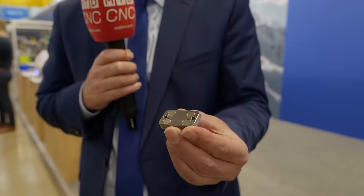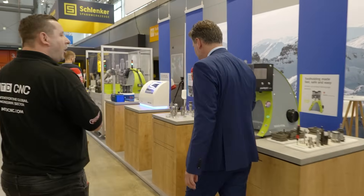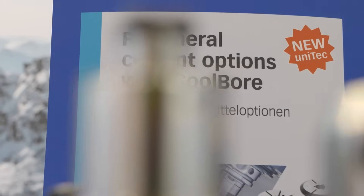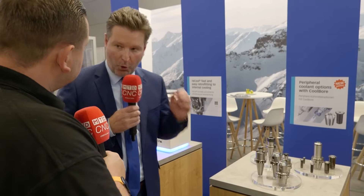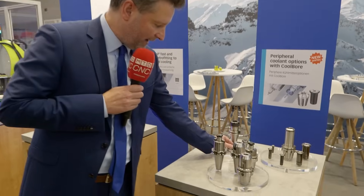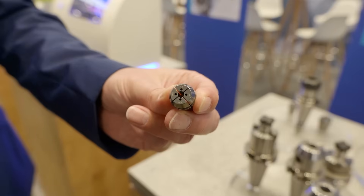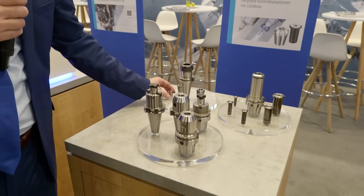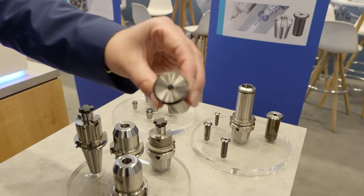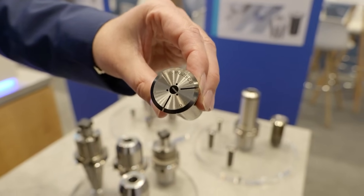Now that's a world premiere — people at home will have never seen that before. But we're going to move on now. We've started with preventive maintenance, and now we're going to move on to helping you run your tools at a more optimal speed and give you a solution people probably don't even really think of. So talk us through your new coolant system. Now we're going to talk about peripheral coolant. Coolant is obviously a big topic — we know we have heat and chips and we want to get them away from the cutting edge. So we have an entire family of what we call Cool Bore, starting with ER. Here we have a conventional ER collet to which we add small bores that can be used for peripheral coolant. We do the same for our power grip collets as well, so the customer can really use these peripheral options if required.